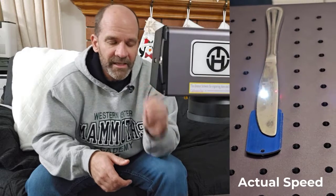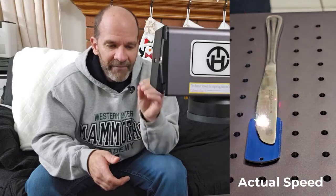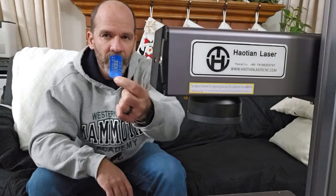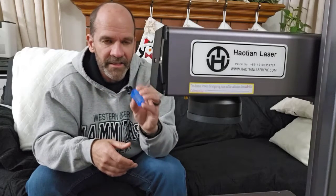Fiber lasers versus CO2: the big difference is fiber lasers can engrave metal — they can engrave into metal and cut really thin metals like foils and maybe a little bit thicker. CO2 lasers can't touch metal unless you put a spray on it to mark it black. Fiber lasers can burn the coating off powder-coated metal, or engrave into the metal itself. By changing the power and speed settings, you can get it to come out white, gray, or close to black depending on the settings.